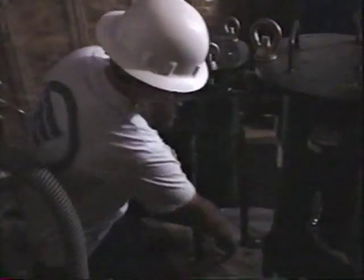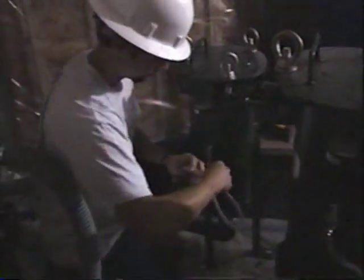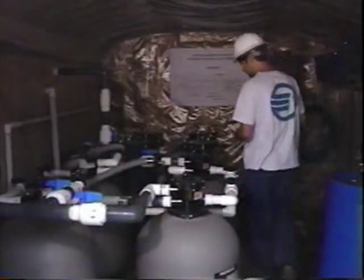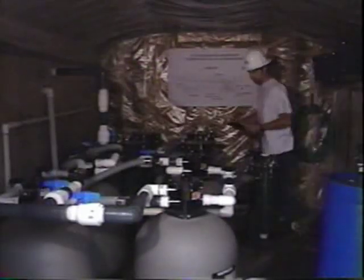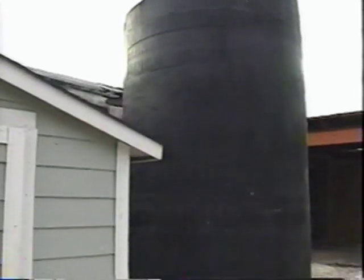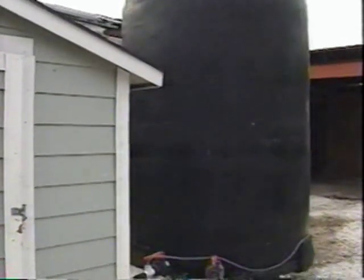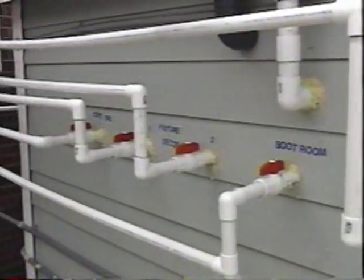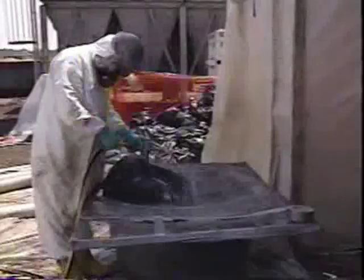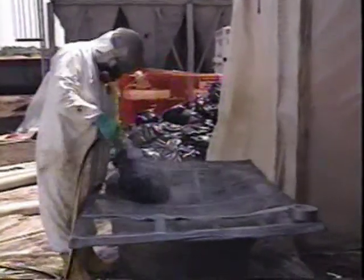One micron is the lowest, 15 microns is the highest. And finally we have a carbon adsorption unit, which will remove any VOC — volatile organic compounds. We discharge it into an effluent storage tank, which is about a 5,000-gallon tank, and this water is distributed to several places within the site to use for, quote unquote, clean water.